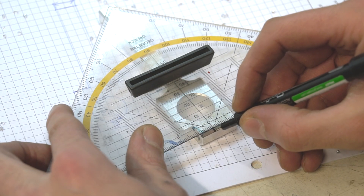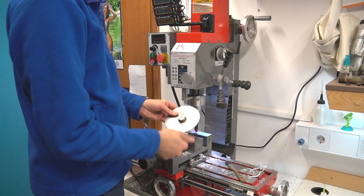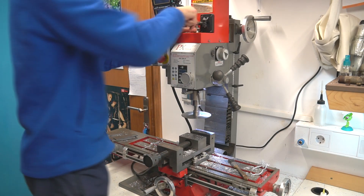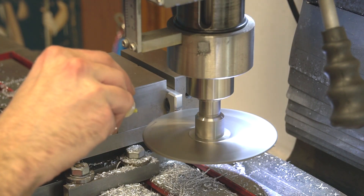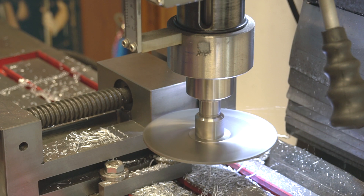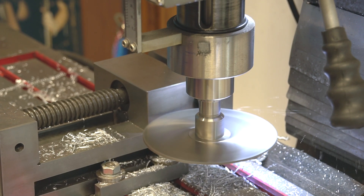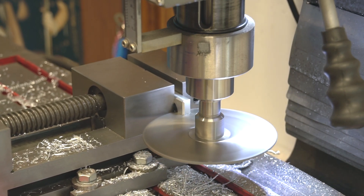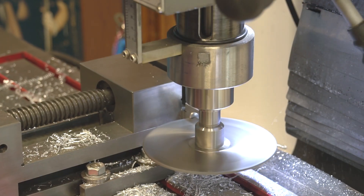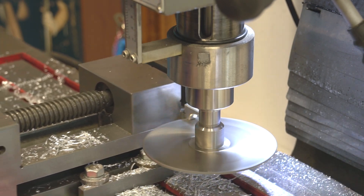Now mark the center of the hole to cut it in half. This groove can be made with an angle grinder or hand saw. But I found this saw in the trash once and made a 20mm holder for it so I can clamp it in the Morse taper 3 collet — it cuts aluminium like butter. When I cut the first wall, put the piece a bit out of the vise and cut a bit more on the other side of the hole, so tightening will be easier and stronger.